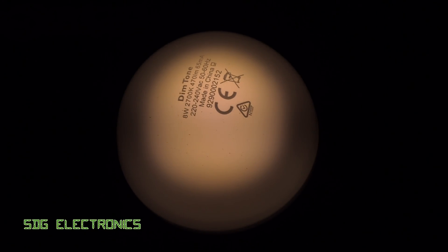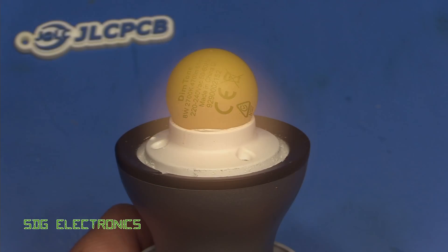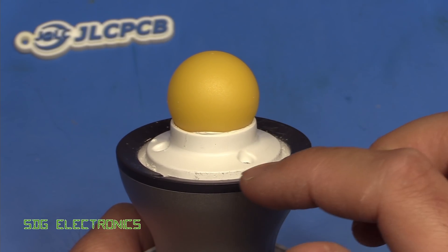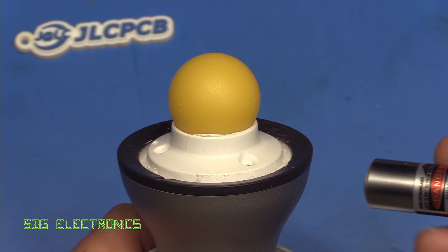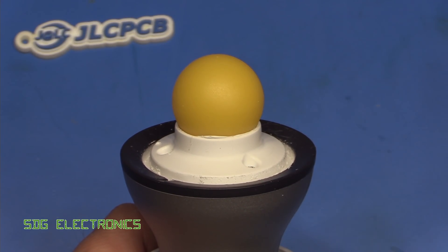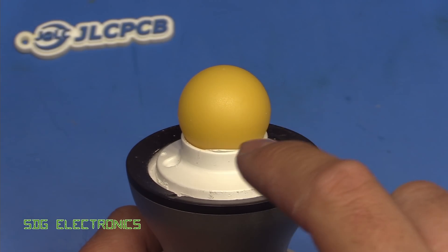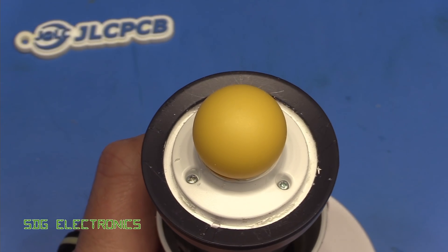The next thing to do is to try and get this lamp apart and see what's actually going on inside. Step one is complete — I managed to smash the glass and get it off, though it was glued in quite heavily. We can confirm this is definitely a remote phosphor lamp: shining a UV laser at it, you can see it gives a very red-orangey glow, which saturates the camera a little. That's definitely remote phosphor.